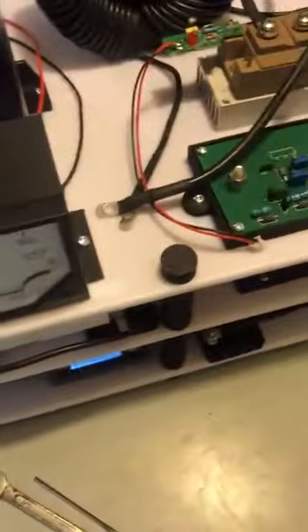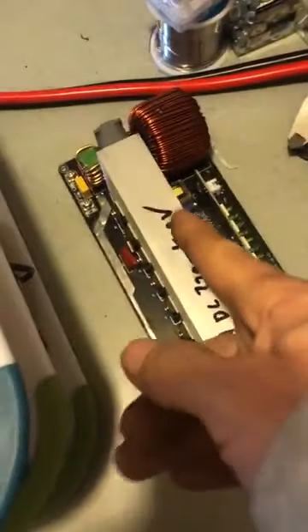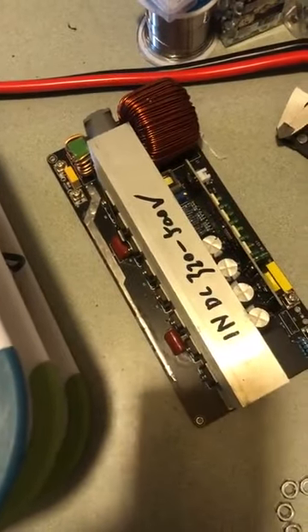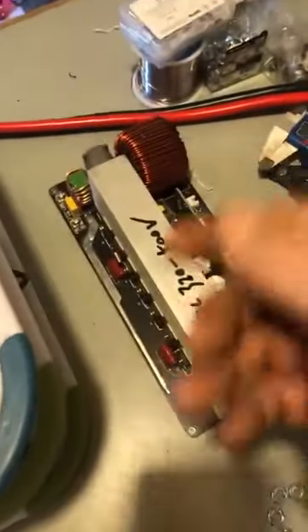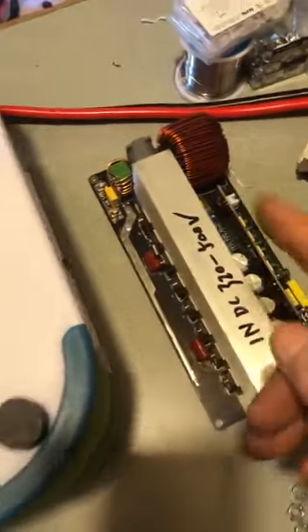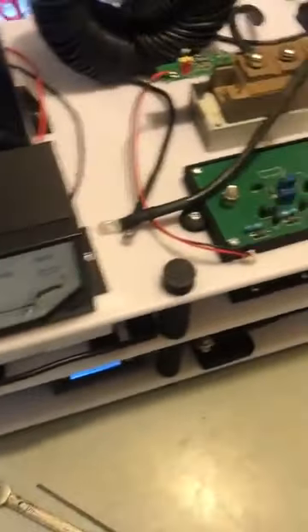When you're not pulling power, he goes open circuit. When you're pulling power, this pulls from your source. So this system is designed to have a big 48 volt — or whatever you want — battery. If we had a better buck converter system on the start, we could run him right on the output capacitor. You just charge the output capacitor, you don't run the inverter, you run the device, and then once the device is running, you load the inverter on your output capacitor. And then it is closed loop, without the battery.